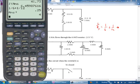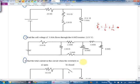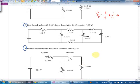Okay. So if I temporarily redraw this, number 7, I have a battery. I have a 10-ohm. I have a 5-ohm. I have a 2-ohm. I have a 2-ohm, there and there. But this whole monstrosity here is the same as a single 4-ohm resistor. Is that okay so far, Sally?